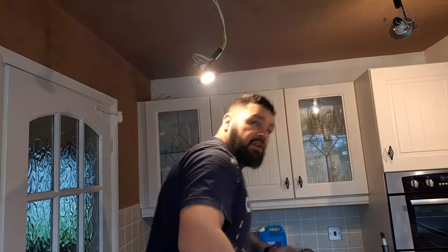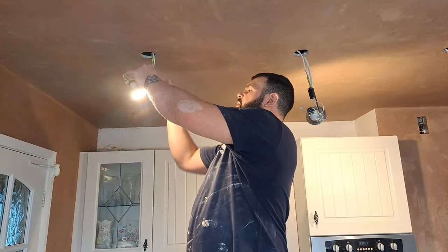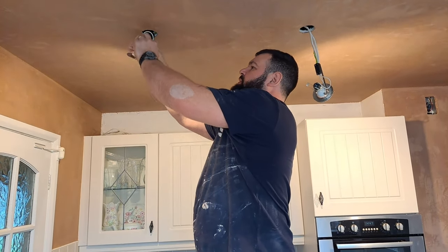Right, that's it. Ceiling's all done. Show them the ceiling, Kieran. All the edges cleaned down nicely. That's all finished. Now, because we did a rolling set, this part of the wall and round there still needed a third trowel and a polish, which will be done shortly. In the meantime, I'm also waiting, all these little lights can go back up.